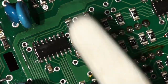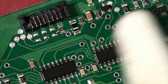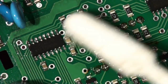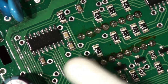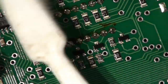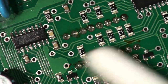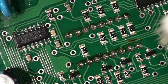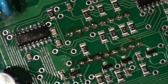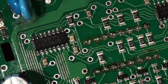Place your bets as to whether this is going to fix it or not. I think not. If this doesn't work it's the micro, and if it's the micro I'm kind of screwed because it's a flash-programmed micro and I haven't got the program. The question is getting the development kit out on a working board and seeing if they've blown the fuse that allows you to read the firmware — if you can't read the firmware out you can't blast it into something else.